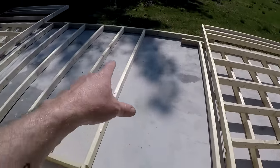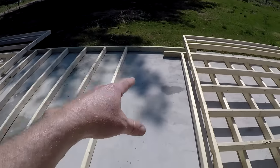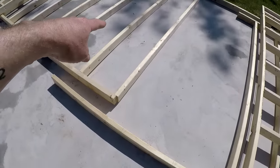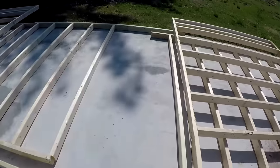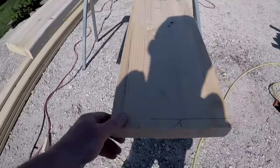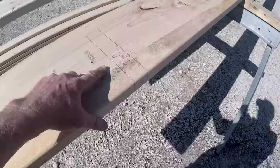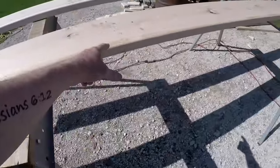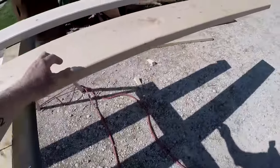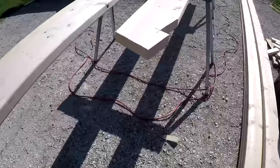This is weird. My plates were wonky. I've got a 16 and a 14, but I had two 10s. So I've got to stand this section, and then I'm going to fill those studs in. Here's a ridge that I dug out, 2x10 because I have 2x8 rafters, 2 foot on center. It's all crowned and laid out. This is a 16 footer, then I've got a 14 footer. It'd be kind of a bear to set, but I'll get it.